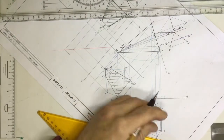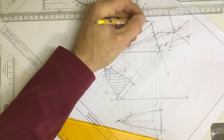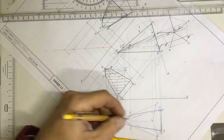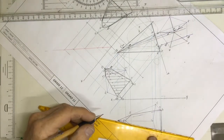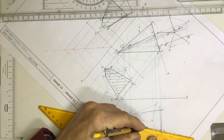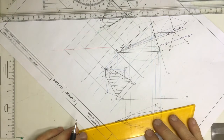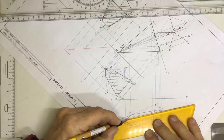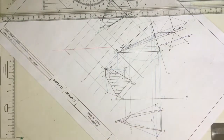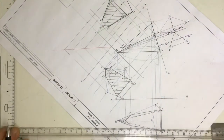Note: number one has been cut away — that section up there has been cut away, so I'm not going to be able to see one up here, or five, or two. Once I've got that, I need to put in the hidden detail between three and zero. Don't forget your hidden detail — it's very important, you will lose a lot of marks if you don't put that in. There's the hidden detail on the drawing.